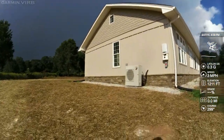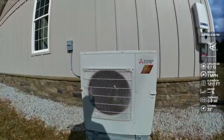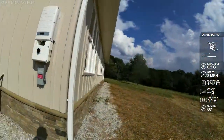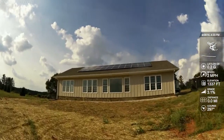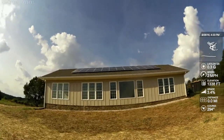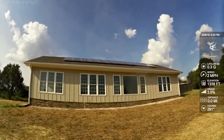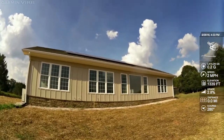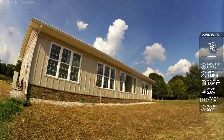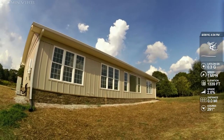You can just barely hear that mini-split running — it's just barely running. The mini-split is cooling and heating the house. They're also going to be heating the house with these south-facing windows. Each one acts like a heater in the wintertime — the sun comes in and strikes the concrete floor, which is an insulated thermal mass. The concrete floor gets charged with the sun's energy and stores all the BTUs, releasing them when needed in the wintertime.